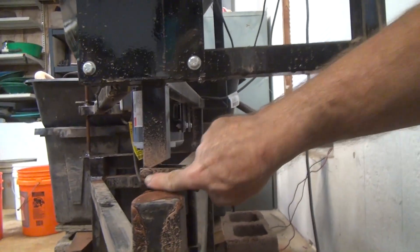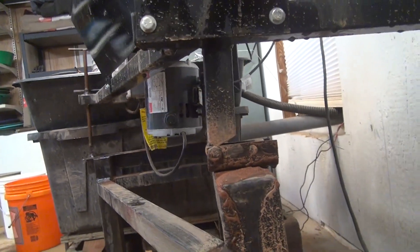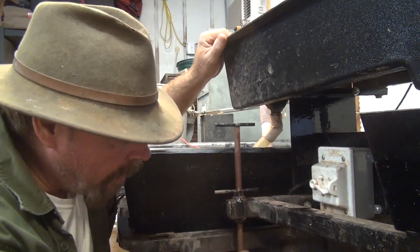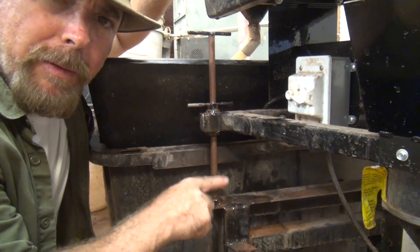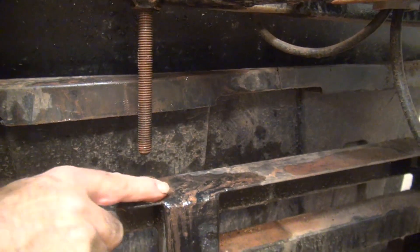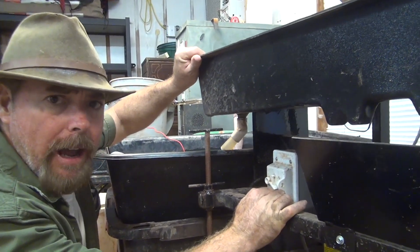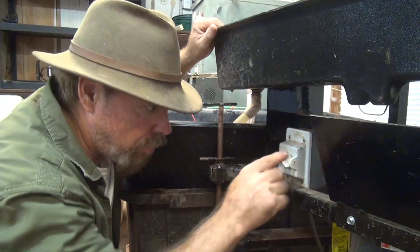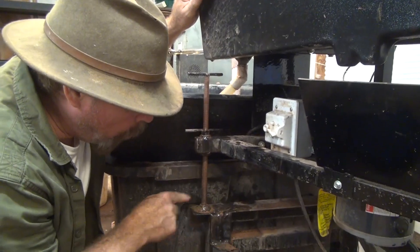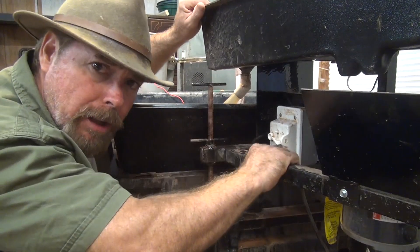The back of the table is hinged — you can see the hinges here. The table moves on these hinges, and they must be bolted down to your stand. When setting up the RP4, the adjustment bolt sits right on top of your stand. When we built ours, we welded a nut on the bottom — that's very important, because there's so much vibration this thing will actually start to move up and down. I've seen people have to strap the lower section to their frame. If you build a stand, make sure you weld a small nut in there so you can thread the adjustment bolt into it to keep it locked in place.